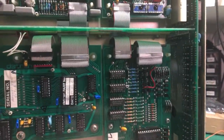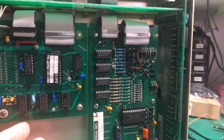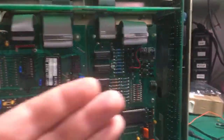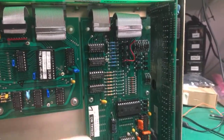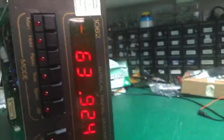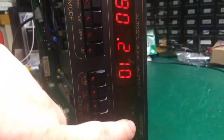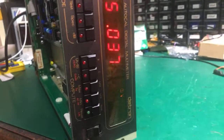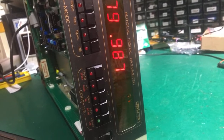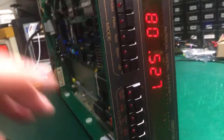I even tried chucking an Arduino board on there to try and read the display information, to potentially replace the enunciators using independent LEDs. I've ordered some LEDs which should be brighter, but I was thinking of using OLED instead. But I was trying to use the Arduino to read that information - because the digital signals are so noisy, it couldn't make any sense of it, it was just coming out as gibberish all the time. So now I've cleaned those up, it should be a bit better.